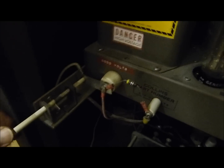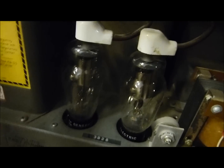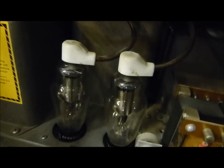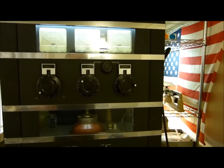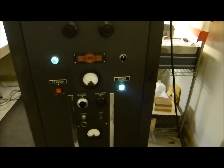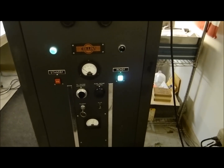I'm probably going to have to tape it and be very careful if we want to see these rectifiers with their beautiful purple glow. Unfortunately, the 866s I plugged in there did not heat up — I obviously disconnected the filament supply from them, they were cold. So we will not be able to see them. I just simply put the solid state rectifiers back in. That'll make it unnecessary to have the back of it open for any reason. Let's see if we can turn this thing on and quickly look at its power output.